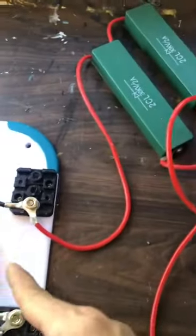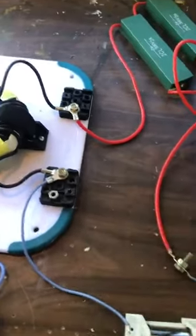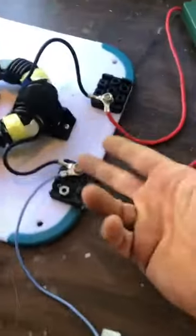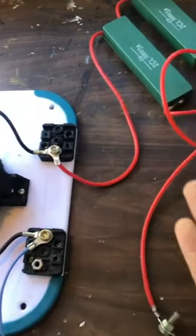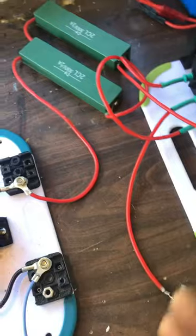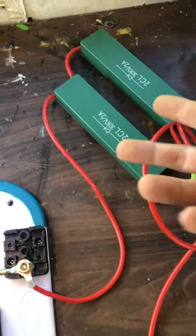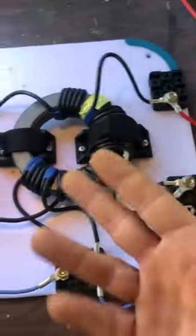Very, very important information there that is just not available. Mica capacitors are going to be ordered for that — we're going to put 200 nanos there according to Don's specs. This basically works exactly like Don's with a few enhancements. My original was going from the cart design, so this was running in AC resonance with no need for the diodes. That did not give me the throughput that I wanted — not to say that it didn't work, it worked perfectly, but at low power.